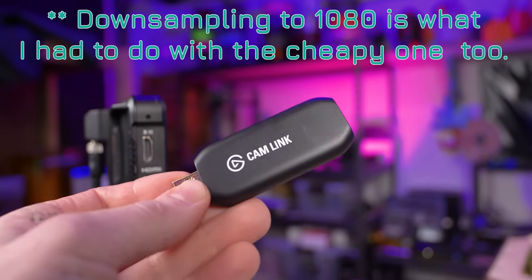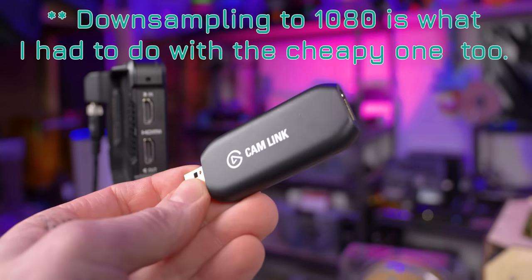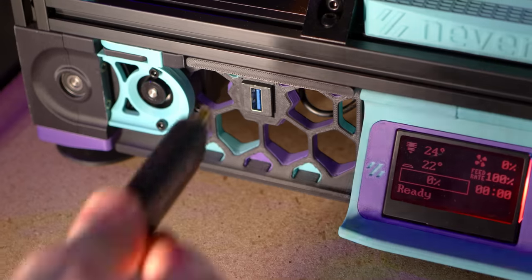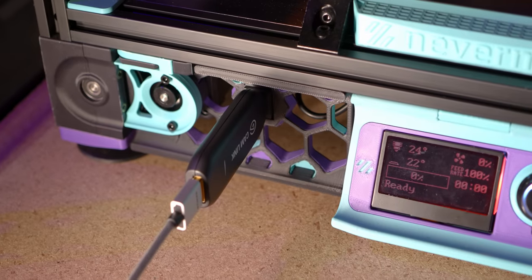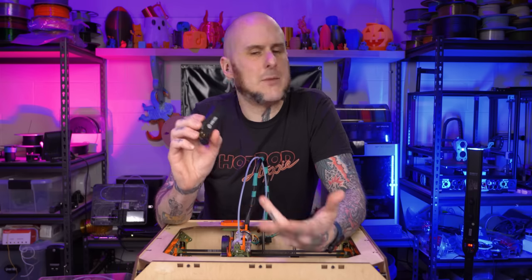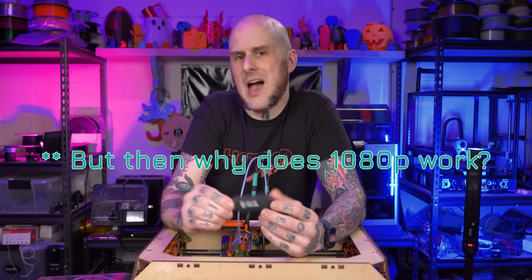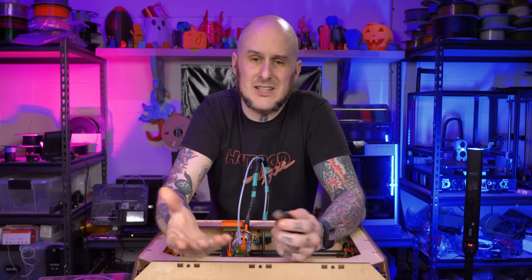Before finishing this video, I did pick up a Cam Link 4K to try out. I was able to get an image if I downsampled to 1080p on my GH6, but not 4K. The Cam Link is 4K capable and works going into my computer, but not into the speeder pad. I also tried it on my Voron 2.4 going into the Raspberry Pi 4 — and again I was only able to get an image. It seems like Mainsail just can't pick up the 4K image; it's probably not putting out an MJPEG stream. I'll need to look into triggering the time lapse shutter functionality on the camera directly, which will lead to better quality time lapses anyway.